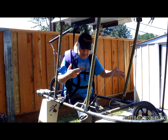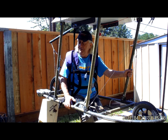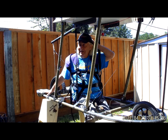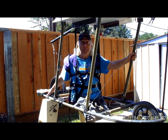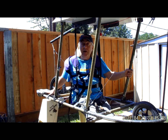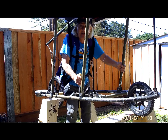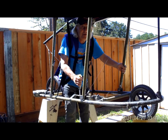I'm set up today with both harnesses on. We're going to get the sawhorses out in a minute and I'll give you a little demonstration. You'll see behind me some barbell weights strapped on the back. You might be thinking I got the weight balance wrong on this lightweight aircraft and strapped 20 pounds onto the back end — but that's not the case. Without the wings mounted, the cockpit is really nose-heavy, so I've put enough weight back here so that when I lift the center section it behaves like it will with the wings attached. The whole thing weighs about 40–45 pounds like this, but it gives me a fairly good simulation of what it's going to be like to run with.